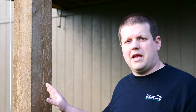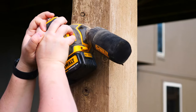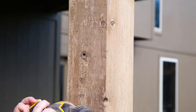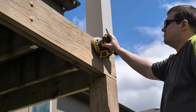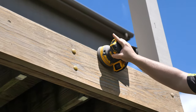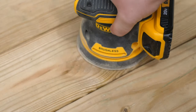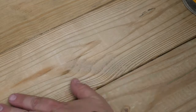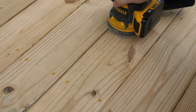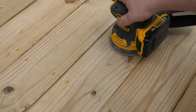To prepare the existing wood that we're not going to be replacing, we pressure washed it to knock loose all the paint that was flaking. Since the wood is now dry, we're going to come back with an orbital sander and knock down any wood fibers sticking out. When you pressure wash, especially getting underneath the paint and into the wood, the water pressure can cause the wood to splinter or turn fibrous. Some of the pressure treated wood used for the deck boards also had some rough spots, so we used a sander with 120-grit sandpaper to smooth those out and give the deck boards a nice, smooth finish.